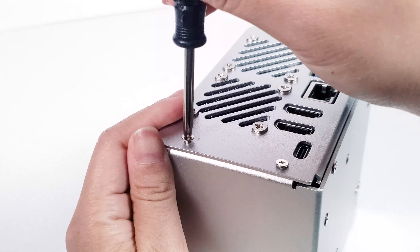Take out the fan and dust filter from the box, making sure the fan's power cable is within the slot. Place the dust filter to the back of the fan, then secure the fan inside Plate B using 4 M3.5 screws. Install another fan using the same method.